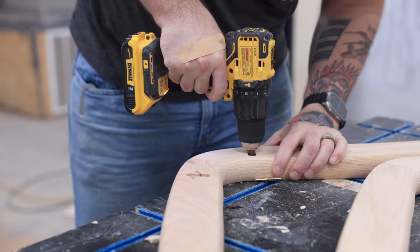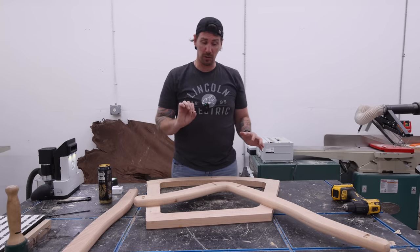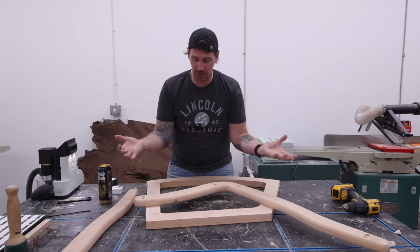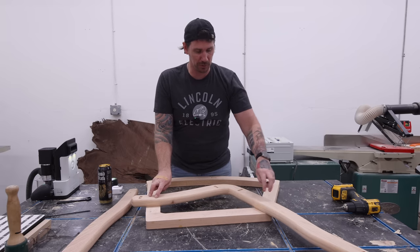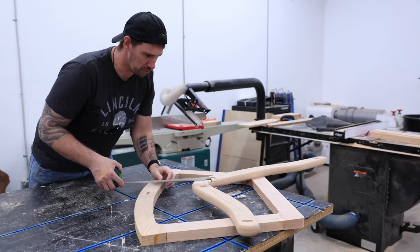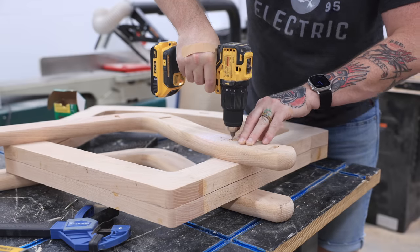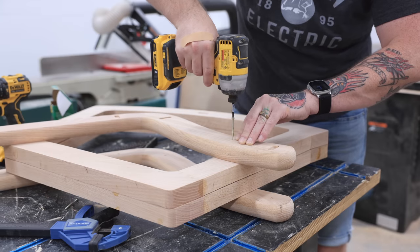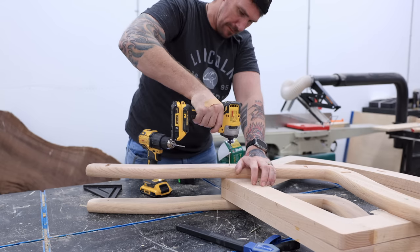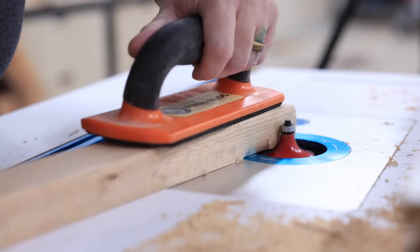I just drilled pilot holes. I'm going to do through-dowels to help strengthen the joints of the stretchers. Now I'm going to drill pilot holes for where I'm going to put those threaded inserts in the rocker assembly — that's how this whole chair is going to be held together, probably two quarter-20 bolts on either side. That full scale plywood model comes in handy again right here as I use it to align the seat to the rocker. Drilling through the seat into the side of the rocker assembly gives me a pilot hole for adding threaded inserts later on, and also allows me to screw these pieces together temporarily while I use one side to align the other. Once I have the pilot holes drilled for the other side, it's time to assemble the seat assembly.